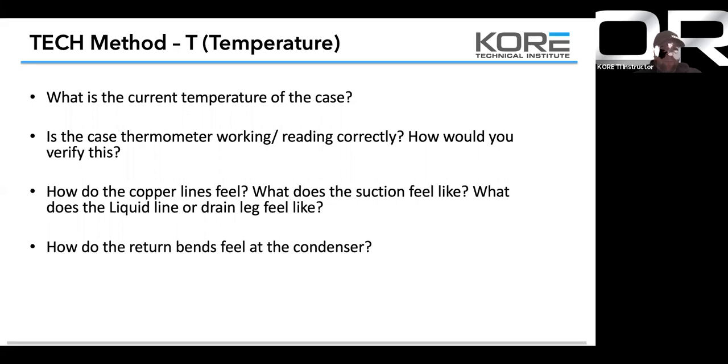If you have any abnormal patterns through your condenser, that's one easy check that you can do. Nothing is foolproof anymore with all the different types of modulating systems we have. But if you're dealing with a traditional remote or self-contained system, and all you have is a liquid line solenoid in place, without a lot of modulating valves, you can do that two-thirds, one-third check, depending on the charge, and it will tell you if it's condensing.